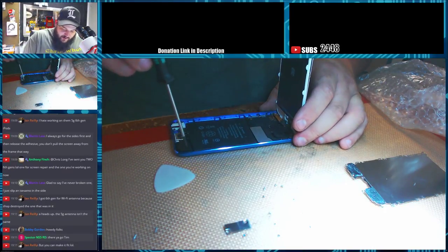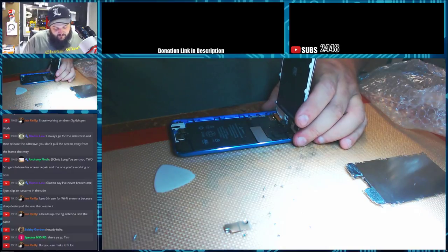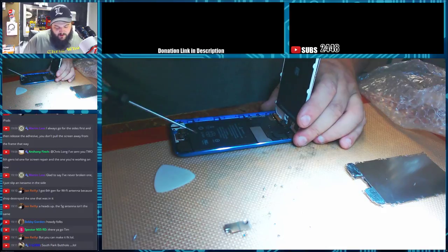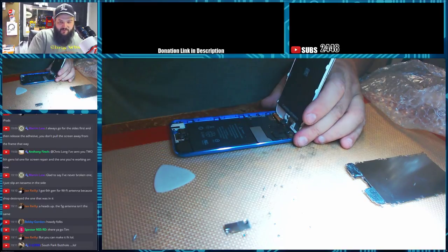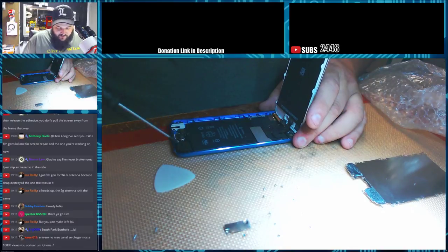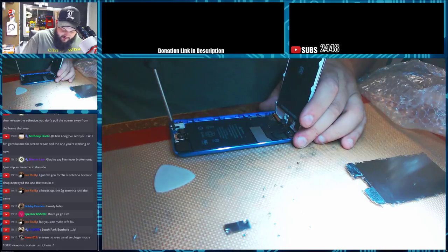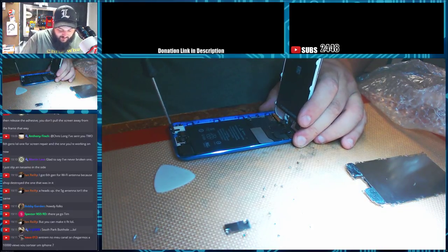I'm going to go ahead and pull this completely so you can see how I access them. The easiest way I found without messing with everything is to start from the bottom of the iPod and work your way up. Take out all your screws on the motherboard and the bottom charge port, unhook the charge port, lift the battery, and flip the whole thing upside down. You can put the LCD screens on these without doing that, but it's a pain trying to get them to plug in. So I found it's easier just to flip the whole assembly over.